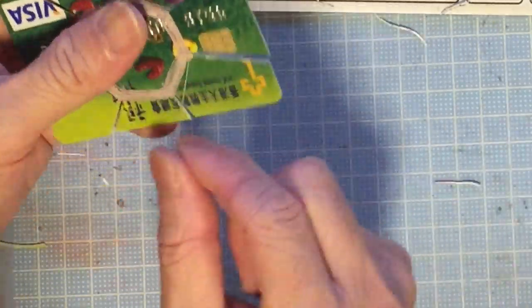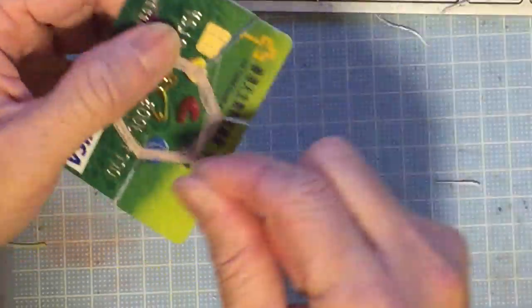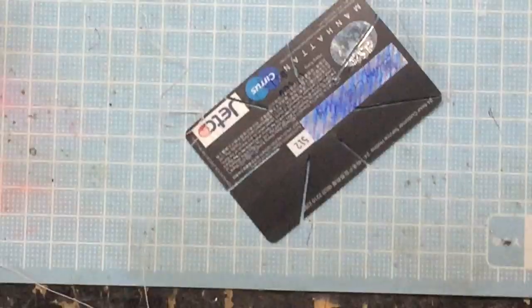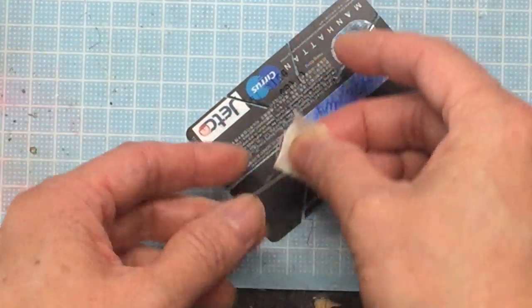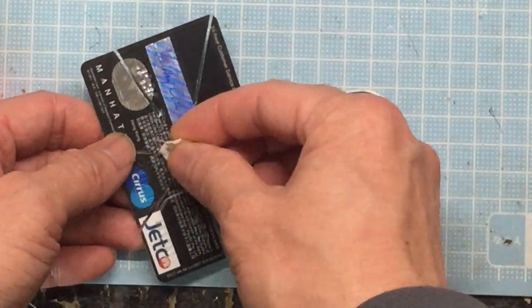You will do fine with regular magnet wire or enameled wire, but you need to choose a wire diameter of at least 0.2 millimeter, or even better, 0.3 millimeter. Otherwise, it will be too thin.